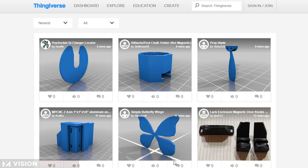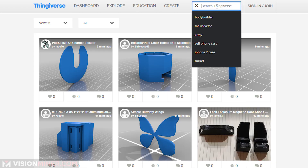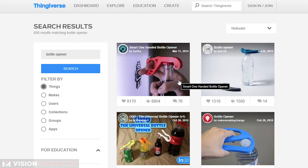Now let's talk about what you can and cannot print. Beginners should start with basic shapes — no crazy angles, overhangs, holes, or bridges — just to learn how the material behaves. You can find existing models on sites like Thingiverse and use suggested settings adjusted to your printer. Start by printing a part that takes five minutes — short fast iterations are the best way to learn. Advanced users can move into complex geometries, overhangs and bridging, while expert-level users can print objects at different angles, use extreme temperature adjustments mid-print, or combine multiple processes for solid bottoms and hollow tops.